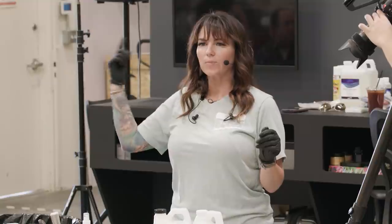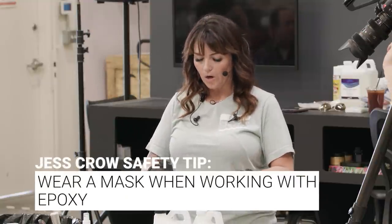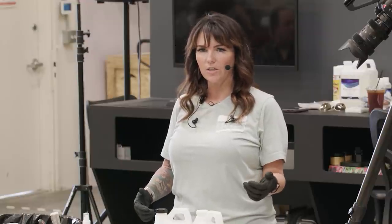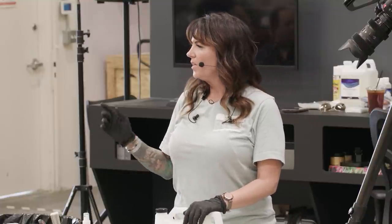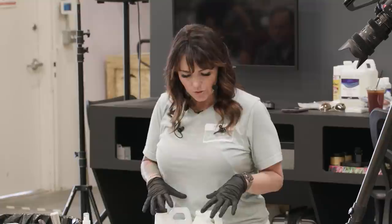Next: ventilation. If you're in a small shop, always wear a mask — even if you are using formulas that are no-VOC. VOC stands for volatile organic compound, which is what used to be in epoxy resins that required a near-hazmat suit to handle. Even though these products have no VOCs, they still leave a weird smell. If you're somebody who can smell perfume from ten blocks away, you are going to be sensitive to epoxy fumes.